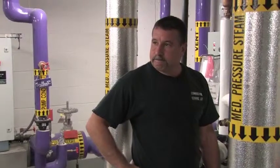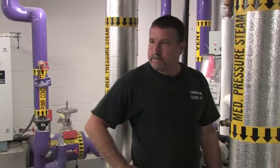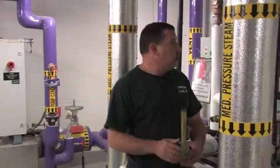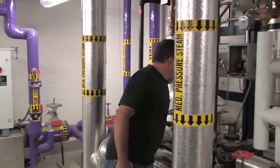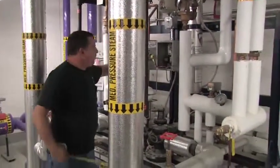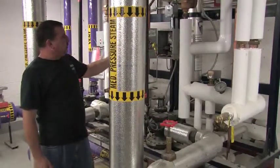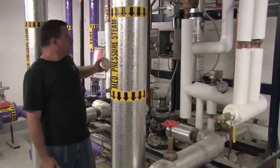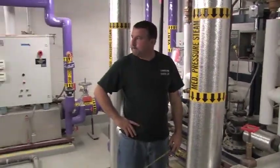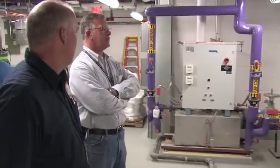As far as the pressure differential switch there, you said an extended period of time. So if the pressure goes down for what, 30 minutes? No, less. There is an adjustment. Oh, there is. You have half a minute to 10 minutes on a dial. It's only like 2 or 3 minutes. Oh, yeah, all right. It's dumped on me during some of the changes we've been doing, adjusting some stuff. If you shut something off, she'll dump if you don't shut the power down.